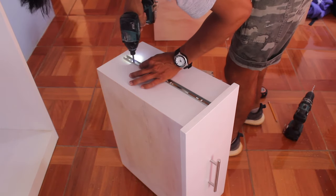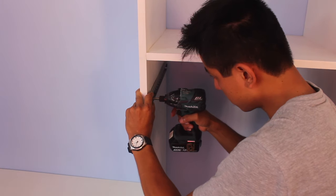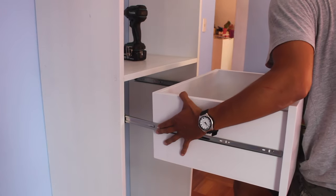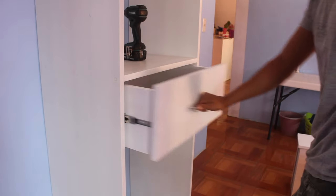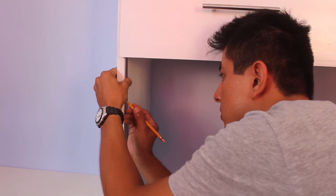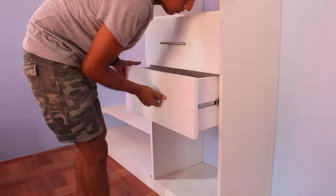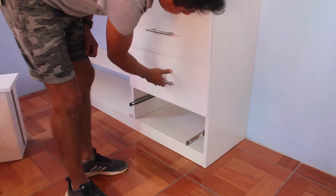The other part of the slide will be attached to the sides of the cabinet opening. I measure the distance from the top to the drawer slides and transfer that measurement to the cabinet. This is a little bit tricky because sometimes you need to unscrew and screw again until you get the slides in the right place. Then line up the slides and push the drawer until you hear the click indicating that the slide parts have re-engaged. I continue installing the remaining drawers, adding two millimeters for the space between each front. After a couple of uses the drawer slides will have a smooth and quiet operation.